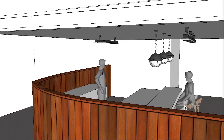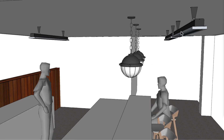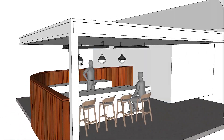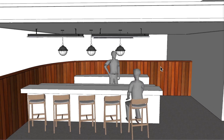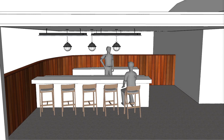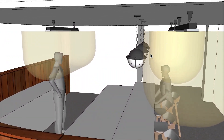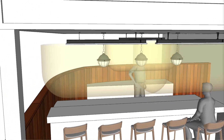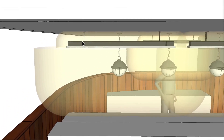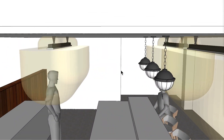From the lamp shades themselves, I've gone 18 inches from this edge to the edge of the heater, so we're meeting all clearances to combustibles. On the below side we've got 18 inches of clearance on all four sides and 36 inches down, so we're meeting all clearances. On top, with the OEM brackets the heaters are pointed straight down, and we're maintaining 6 inches of clearance above all three heaters.